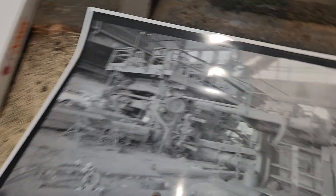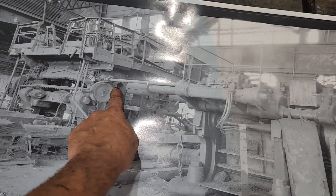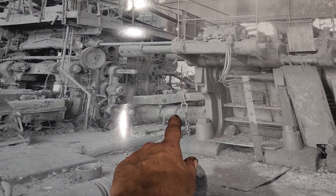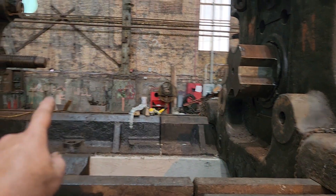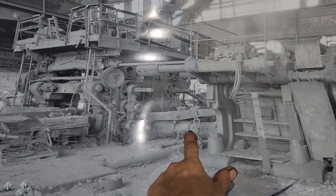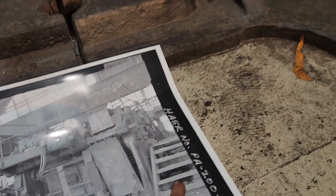We also have this large shaft, which is right there — that has to go up here in its bearings. There are two of those, and then there are the other shafts that go through for that bearing all the way through, and those are sitting right there and also have to go on. And then there are the spindles — this spindle transmits power from the bottom pinion over to the bottom mill roll, so it goes in right here. There are a couple of saddles here — the cross piece with a bearing — that takes most of the weight of that spindle.